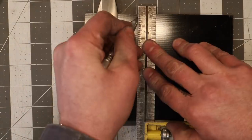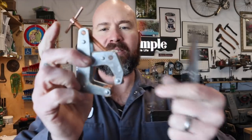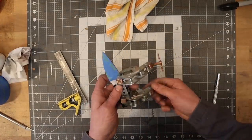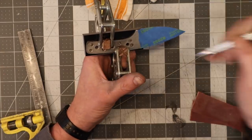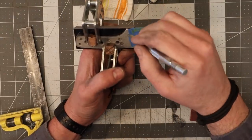This is obviously a very boring process — I just lay it out like this, take a square, and clamp it together using can't-twist clamps, which are fantastic. Then we put both layers of G10 together, clamp this down, and use the three pin holes as guides to drill through both sets of handle scales at the same time — really accurate and really fast. With a decent set of can't-twist clamps locked down super tight, nothing moves. We got it drilled out, now I'm going to trace the outline and figure out roughly where I want it to come.